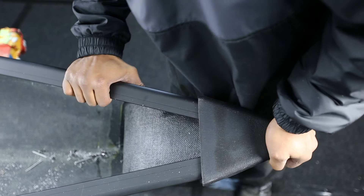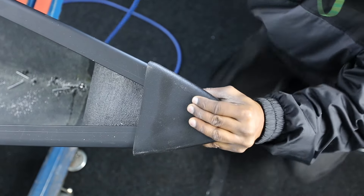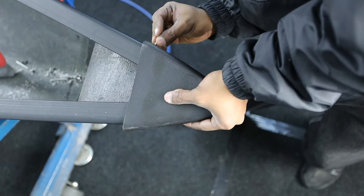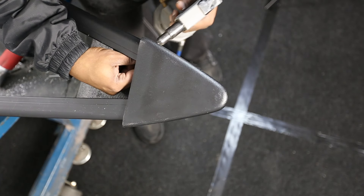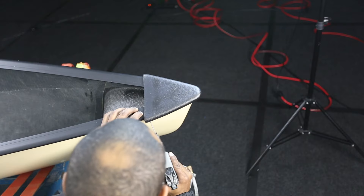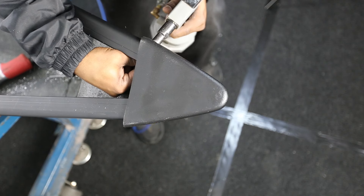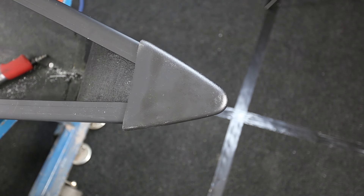If the old deck plates don't work, place the new deck plate snugly into position. Using your number 7 drill bit, drill a hole through both the deck plate and the canoe wall. To ensure strong rivet placement, drill the new hole so that it is a half inch from the edge of the back side of the deck plate, nearest the gunnels. Once drilled, insert the rivet in the hole from the outside and place a backing washer over the shank of the rivet from the inside, then set the rivet. Repeat this process for the same hole on the opposite side of the same deck plate. Once these two have been set, you can evenly space two more rivet locations on each side of the deck plate using your pre-marked drill points. Drill your hole, set your rivet, install the backing washer, and then set the rivet. Repeat this process to install both new deck plates.